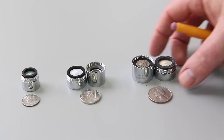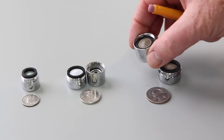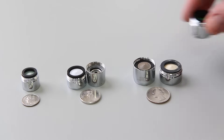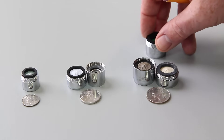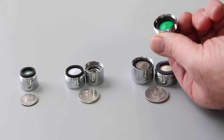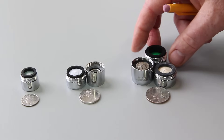The standard size is 15/16-27 male or 55/64-27 female. This also comes available as a dual thread — that's where you have one aerator housing that has both threads. You can see this has the female threads on the inside, the male on the outside, and a split washer. That's the way we sell many of our standard aerators.